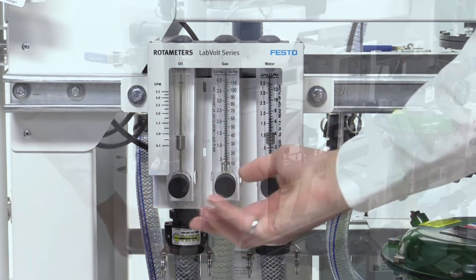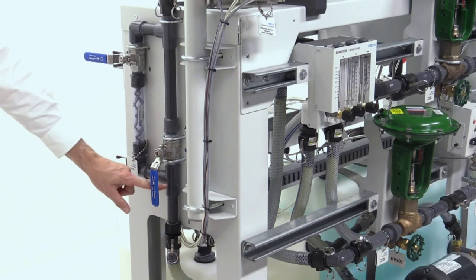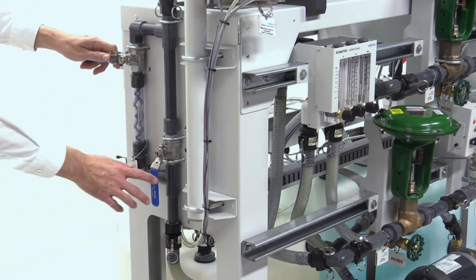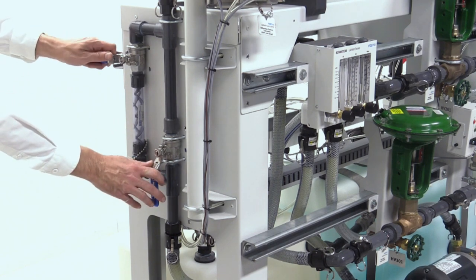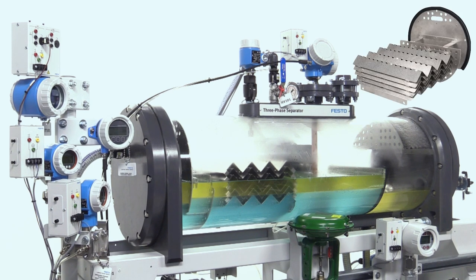The rotameters allow students to control the proportion of water, oil, and gas in the crude oil emulation mixture. Water, oil, and air are sent through this tube. It is possible to send this mixture to the inlet zone of the separator as-is, or to divert the mixture to the inline mixer by turning these handles to blend the fluids. The large clear acrylic vessel and clear PVC piping allow for observation of flows and internal components during operation. It includes typical elements of a three-phase separator such as a diverter plate, a perforated baffle plate, coalescing plates, a wear plate, and a demister pad.